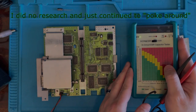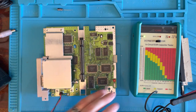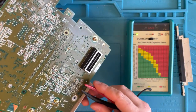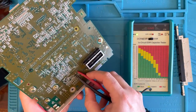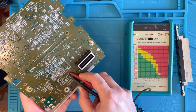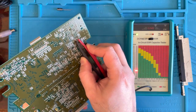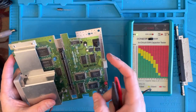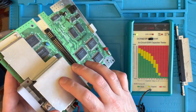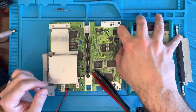Okay, so I've been poking around a little bit. In my mind, if this fuse keeps blowing, that means something is shorted that shouldn't be. So I've been testing these capacitors — I have this nifty little in-circuit capacitor tester. I've been testing a couple of these capacitors here, and this one shows up as being bad — it's a 220 microfarad capacitor. And this one over here also shows that it's bad. So let's pull out these two capacitors, replace them with new ones, and see if that makes any difference.